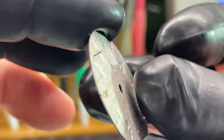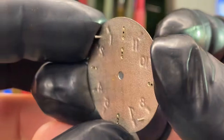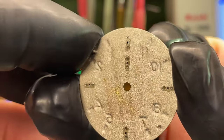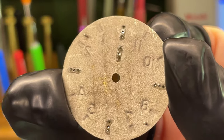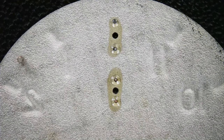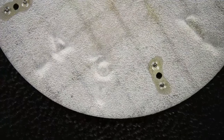Underneath we have the NH35 movement, and it's got a date wheel, which means it has a ghost position on the crown unfortunately. Here's the dial in my hands — a lovely looking thing, very well made indeed. It says 'oil pressed' — not sure what that means, but it must relate to the punch or die used. You can see it is metal and embossed from that pressing. Interestingly, the 12, 3, 6, and 9 indices and the San Martin logo have been pinned through the dial and glued on the back, which is very reassuring as they shouldn't fall off.